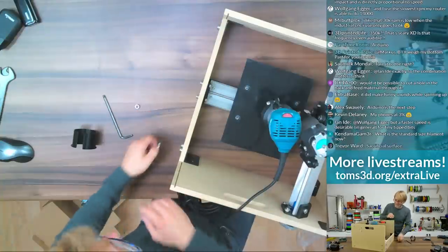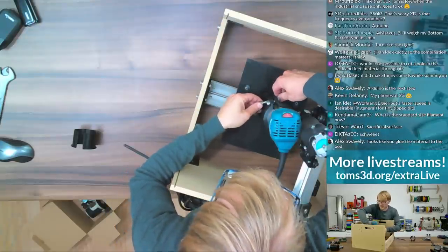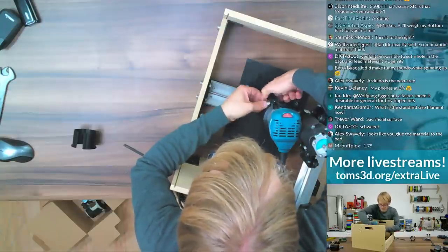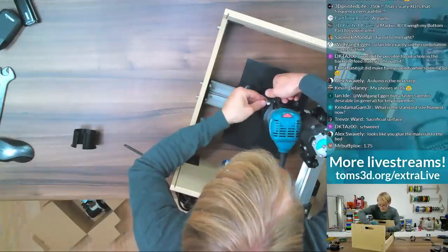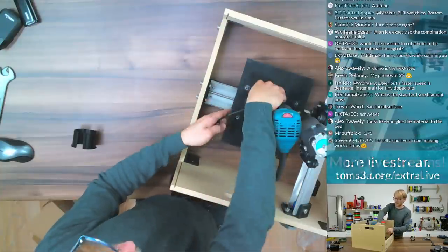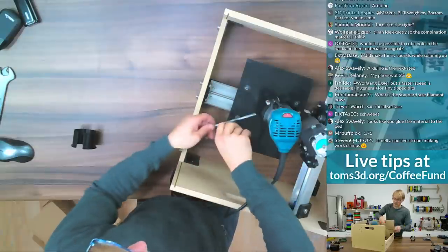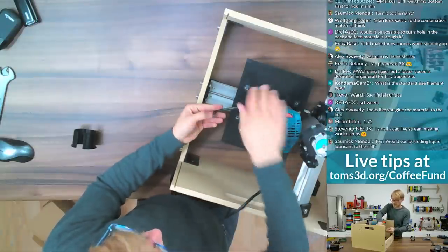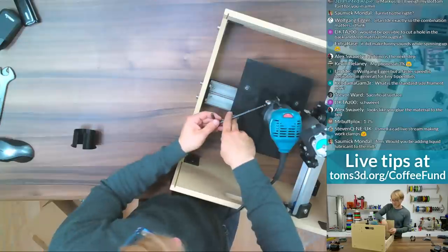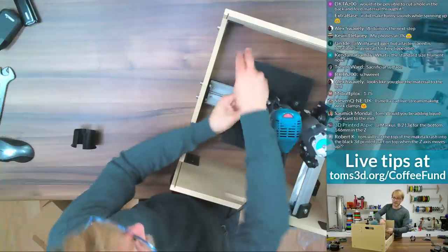It's interesting how terms get mixed up here. How large is the build area of this mill? First of all, it's not a build volume because you're not building anything, you're machining stuff. You're taking away material. And the volume, most of the time for a CNC setup, doesn't matter that much because you only have so far that a mill bit will go into the material before your router or your mechanics get caught on something. So the most important thing, at least on a 3D mill that has three axes and not four or five, is going to be your build surface. And someone in chat is going to copy paste the exact dimensions.